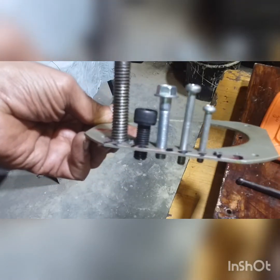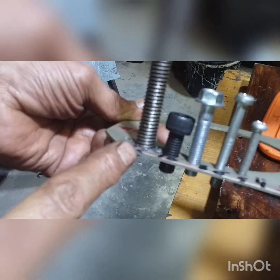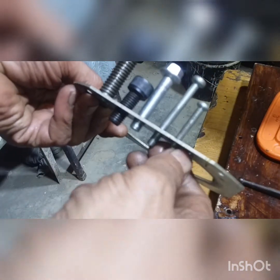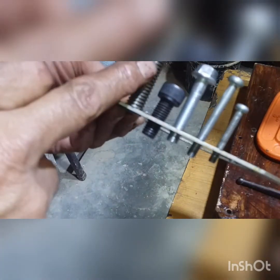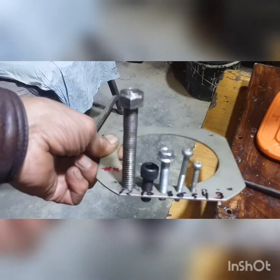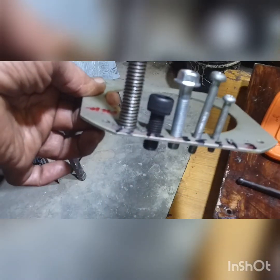I don't have number 4 right now. It's in my toolbox. I did 5, 6, 8, 10 and 12. On camera, you can see all through this one. Everyone, but I don't have this bolt. I use the another one. That's the BSW thread. These are not metric threads, so I want to show you that it's also 12 millimeter. It's called half inch BSW.